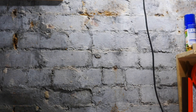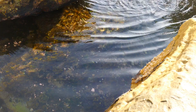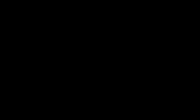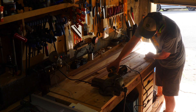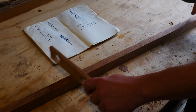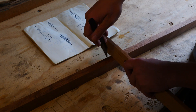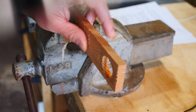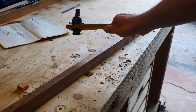With this revelation, I went away and made a couple of models, loosely trying to capture the motion of the waves and the twisting of the coastline where I live. Tilly, being the lively animal she was, left the strips pretty rough so I sanded them down to make things easier later on. I started prototyping the lamp and figuring out a jig to help with the bending. The lamp will have a central stem, but I need to connect the bulb somehow. With all the chaos of twisting wood, I thought another straight line would help break it up, so I took an offcut of Oregon and notched it out to fit the stem.